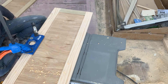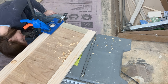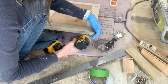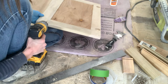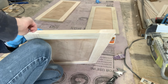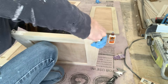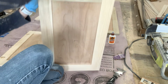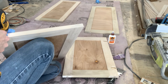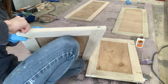I used a concealed hinge jig to drill all the holes in my doors for my hinges, and I like to do this before I paint. That way, if it chips or makes an imperfection, I can fill it and touch it up before painting rather than having to fix it after a fresh coat. To be able to paint both sides of my door in the same day, I drilled really thin holes in the least visible spot — at the top or bottom depending on the cabinet — put little hooks in them, and hung them on hangers. That way it was easier to paint and then hang them to dry.